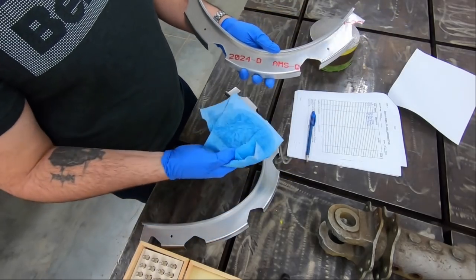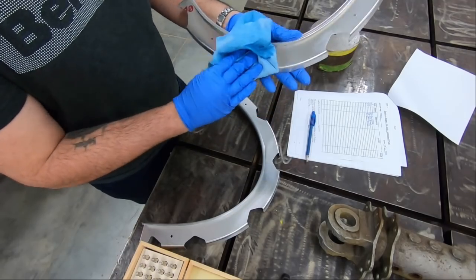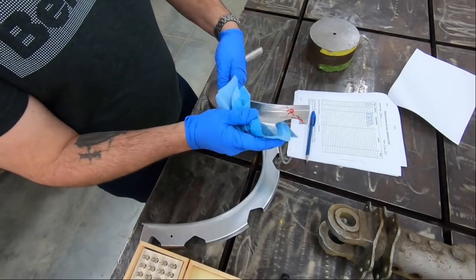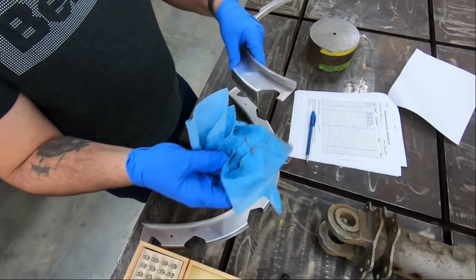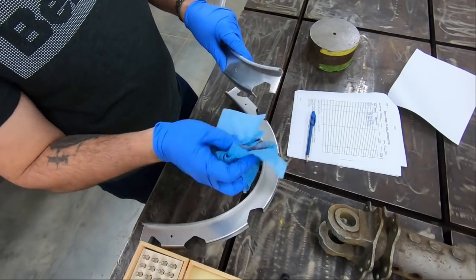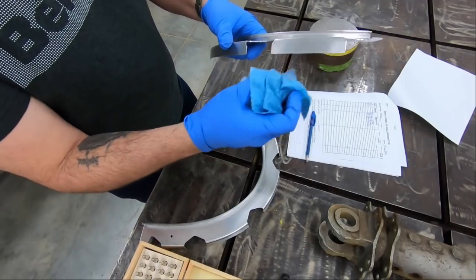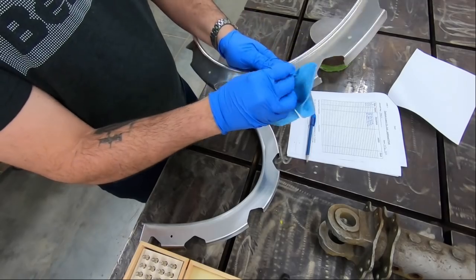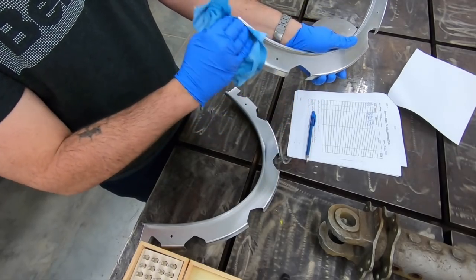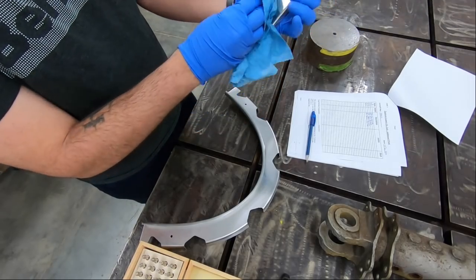I've got some gun wash on a rag and it comes off fairly well. You have to be careful putting the ink side out on repairs because the ink, if you leave it there, will actually bleed through the primer and you'll be able to see it. So that's just a little clean process I'm going through with this one — get rid of all that stuff. It's not good to have it on there when it goes into the furnace for heat treatment.